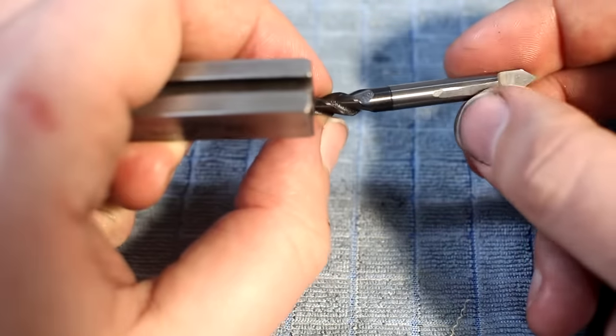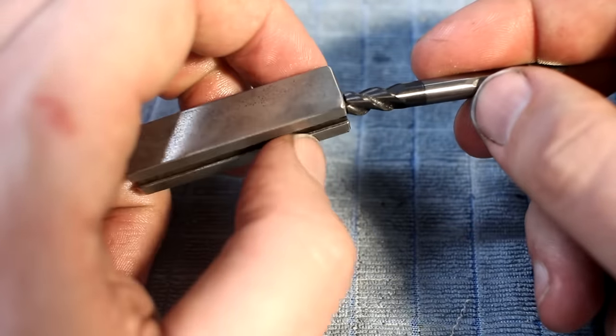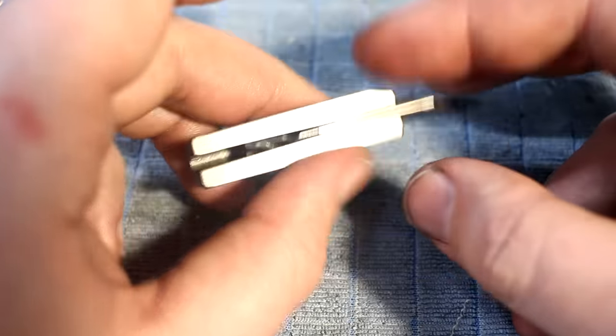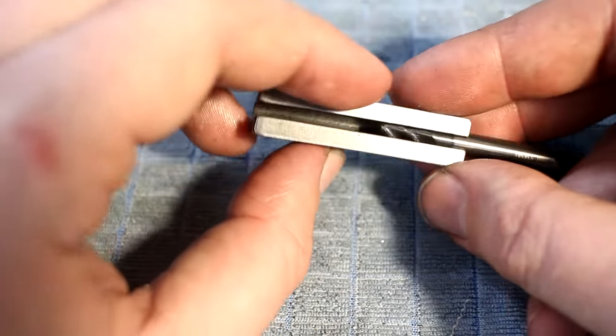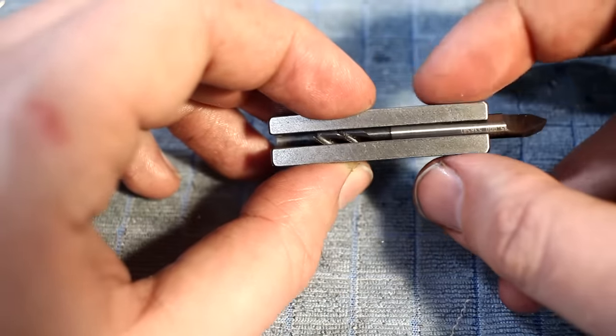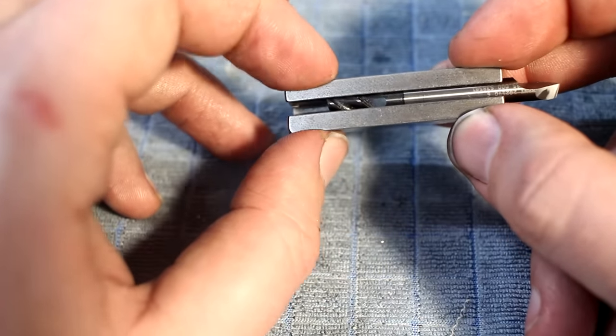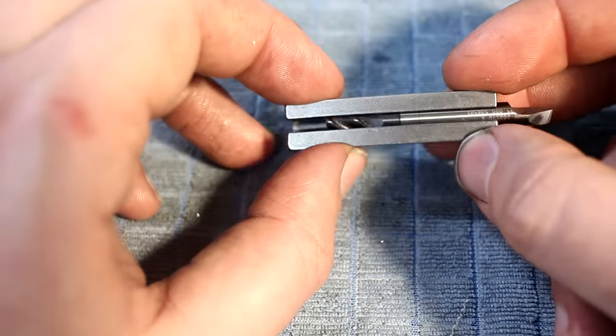And yes, I usually do not bother to cut off the old end mill side. Doesn't hurt. When you clamp a tooling block like this, usually you clamp only over the tool, not back here in thin air, because you will permanently deform or break it.